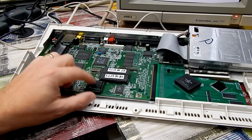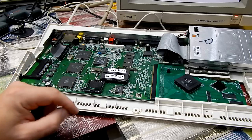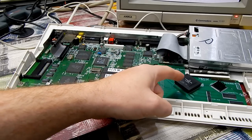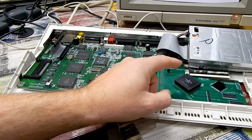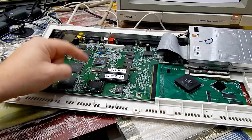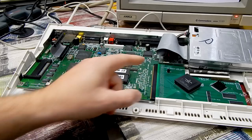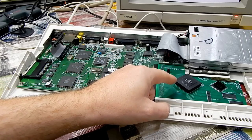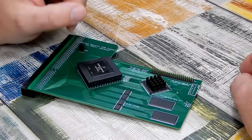But still just 28 megahertz. As I said, that is a 40 megahertz part. Do you know what else was a 40 megahertz part? That CPU, and as you know, we've pushed that out to 60. What would happen if we disconnect that wire, bring it this way, and connect it up to that 60 megahertz clock running that chip? Right, where are we going to pick up this 60 megahertz clock?